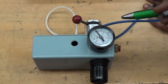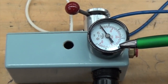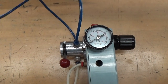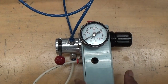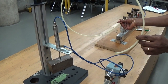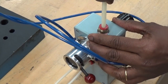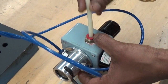This is a half inch bore diameter station. This is the air regulator unit. You can see the dial with the markings for the air pressure. These tubes would all be connected - you don't have to bother about them. Your connection is from the air supply unit to the regulator inlet here. From this outlet I am connecting to the regulator. Just a press to connect it, and if I have to take it out I just press here to release it.